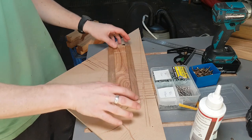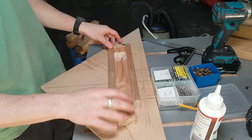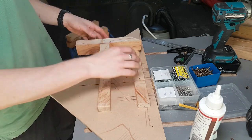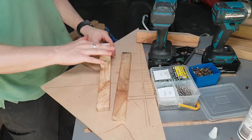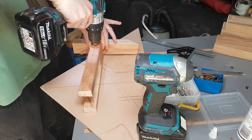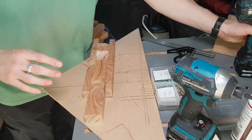Assembly time — I thought I'd do the back pieces before I started chopping up the others, just so I don't get confused. There's going to be a lot of bits floating around by the end of this. The brace is the spacer I need to measure everything up, allowing for the saddle joint at the top as well. Glue and screw all the pieces in. If the spacing isn't perfect it really doesn't matter here — these are just going to go roughly together and there's enough wood that small gaps aren't going to matter even if they can be seen. The strength should still remain.